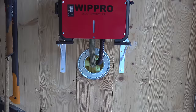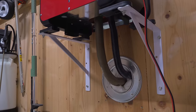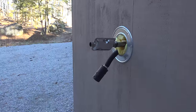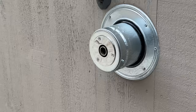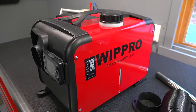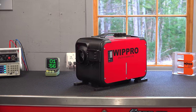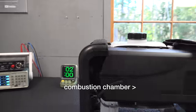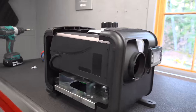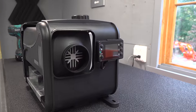It's not really Chinese — they're just made in China like many other products. The real point is they are inexpensive, affordable, and super easy to install. Nothing in this video is sponsored. You need to understand what these diesel heaters really are. Surprisingly, they're very simple devices — a fuel tank along with a fuel pump and then a combustion unit, burning diesel fuel inside of a sealed combustion chamber, operating kind of like a heat sink with air blowing across the chamber.